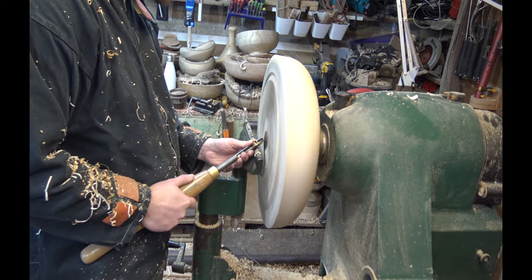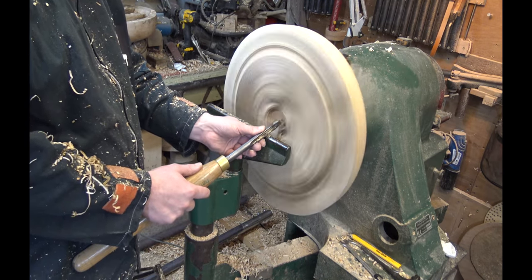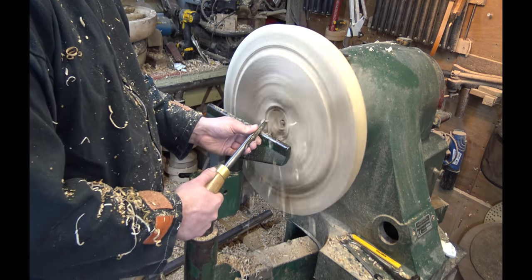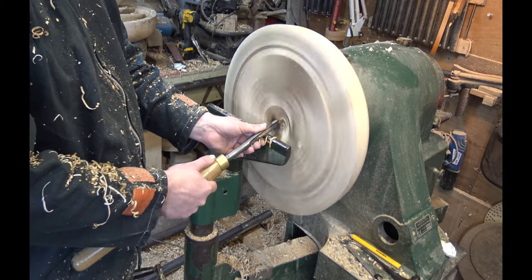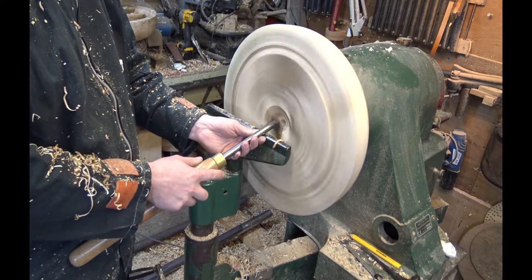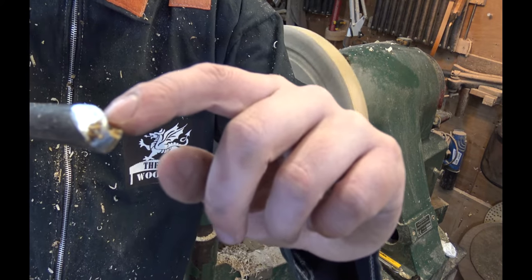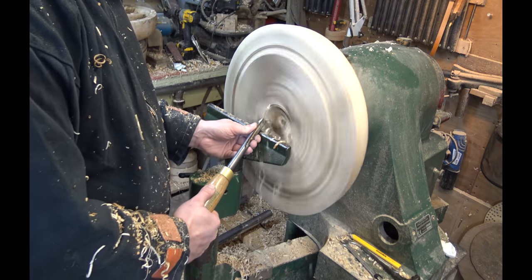Each time I'm taking a tiny bit more off, and the tool won't just push forward as you're doing this. As it's starting the cut, a lot of my turner friends will do a little dig as a security move just in case the tool wants to go backwards, and then they'll take off. I've got constant bevel contact cutting downhill at all times — if I start cutting uphill towards me, what can happen is the bowl spinning around grabs that lower ring, pulls it round, and you have a nasty catch. I always try to cut downhill to avoid that.